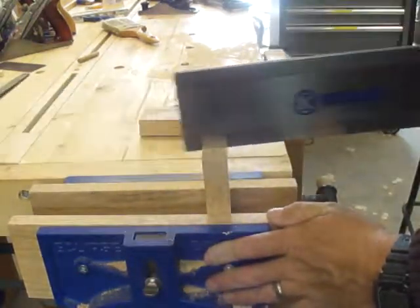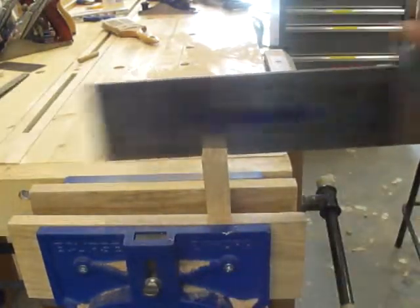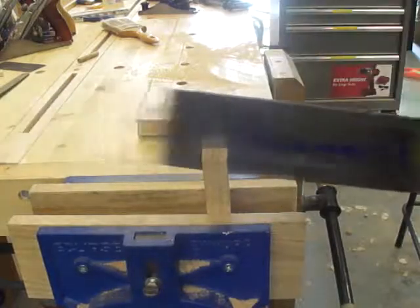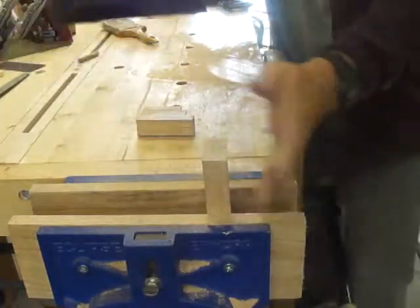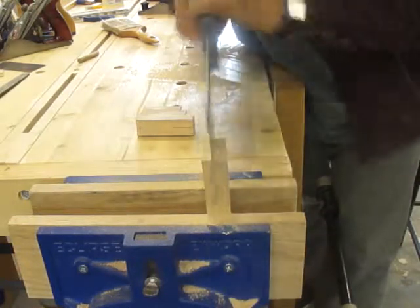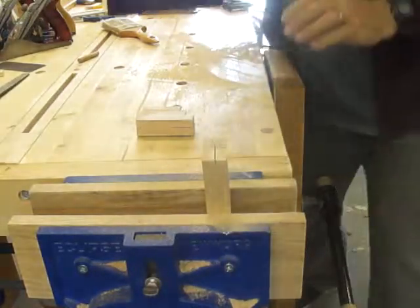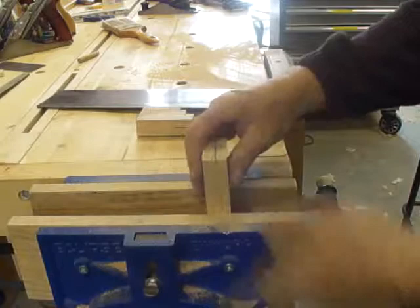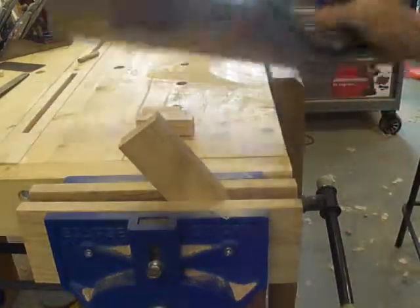And it cuts smooth now. There's no grab. Oh, there might be, you know, one tooth somewhere that would want to grab a little bit. You never know if that's the wood or the tooth or your saw or any number of things in the grain of the wood. It's cutting really smooth like that. You know, sometimes it's like a chisel. Sometimes you're against the grain and you have to tilt the saw one way or the other to cut.